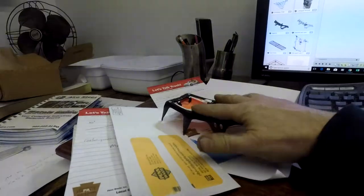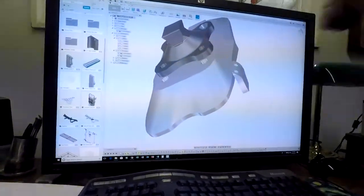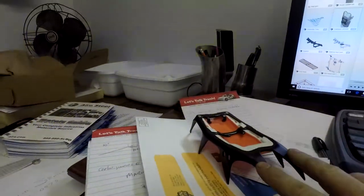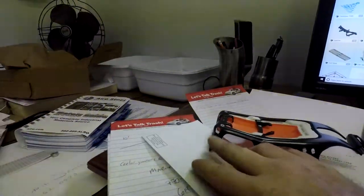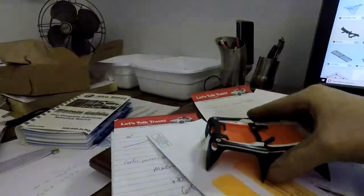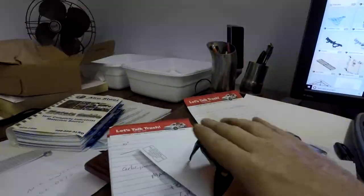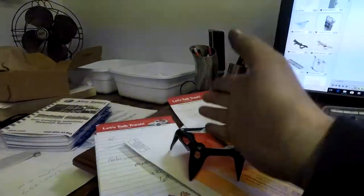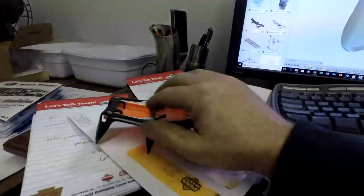That actually attaches directly to the prosthetic lug, to this guy right here. And if that attaches directly to this here, I'll just remake this plate. And I figured you can have two prongs in the front and two prongs in the rear. There's no real need to have the six prongs like this has, because this is for the ball of a human foot, and then you'd have a heel. But with a prosthetic leg, you're just going to have a direct limb that comes down. I can't imagine that you would need something bigger than that.